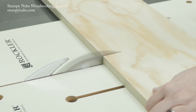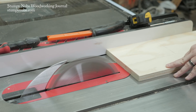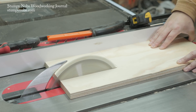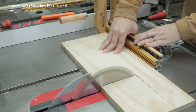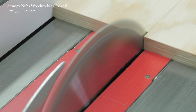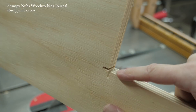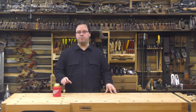These will support the main platform on the workstation, and I want them all to be even. So instead of using the band saw to cut the rectangular cutouts like I normally would, I used the table saw because the fence would ensure that each cut was perfectly straight, smooth, and identical from piece to piece. I also used a wood clamp on my miter fence to finish each cut. And before someone complains that I have my table saw blade raised way up, I did that on purpose to reduce the size of the overcut on the backside of each piece.